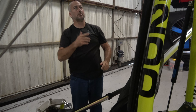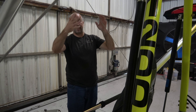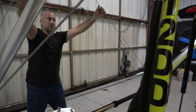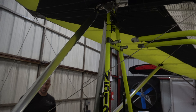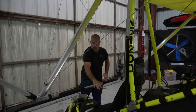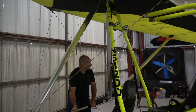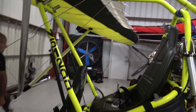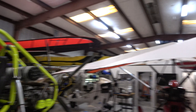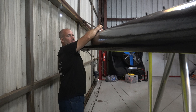You don't have to worry about the mast falling down — it's balanced, and once it gets down to about here the mast lift assist is engaged, so I have to pull the wing down at this point. I'm very carefully watching to avoid hitting propellers and wings, going nice and slow, bringing the wing down. Now that the wing is down I can go ahead and remove the nose cone.